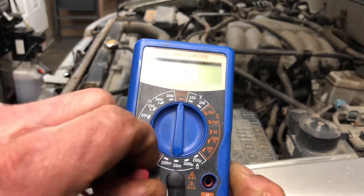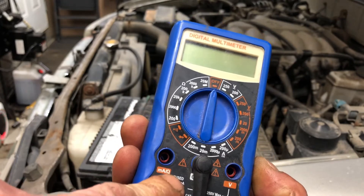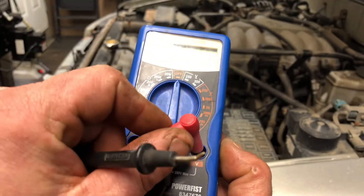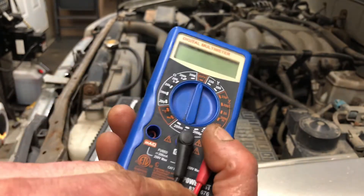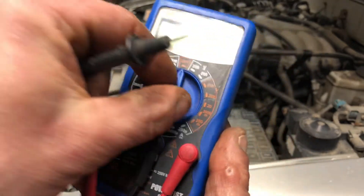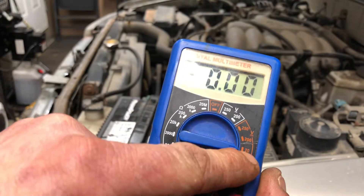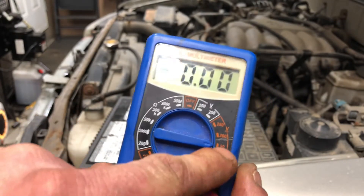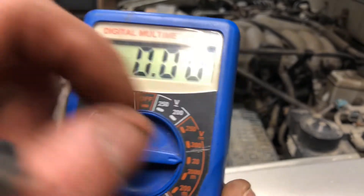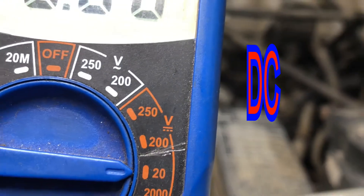I was checking for broken wires last time I used it, so I'm gonna pop this out — it says milliamp and ohms. We don't want that, we want volts. We're gonna go right here. Black will always stay on the com side. We're gonna turn this to the 20, and we're going to make sure it's on the voltage one with the two little lines, as you can see there. Two little lines.